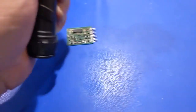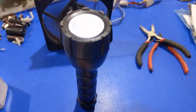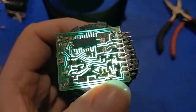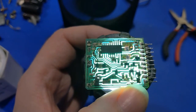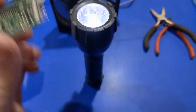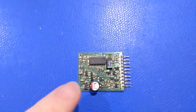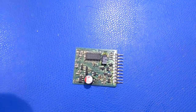I checked the black traces and believe it or not they're connected. The board is fairly small, so let's take a look to make sure we don't see any dead spots in the copper — it doesn't look like we do. So I think we're good to go and can just put the caps on. I got the new capacitors installed. I didn't have a tantalum for one position so I used a polymer cap — it'll work just fine.